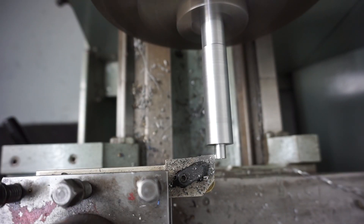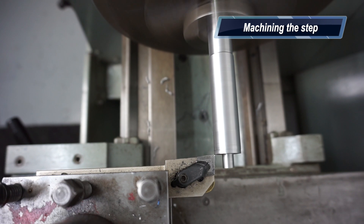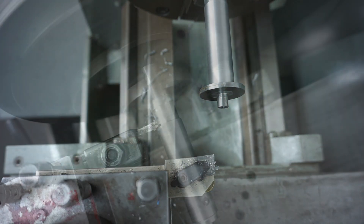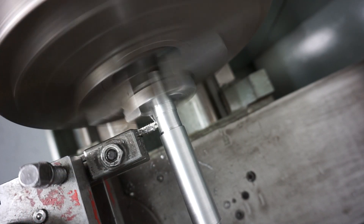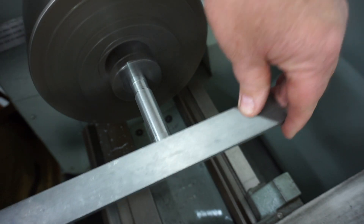This is a little spigot that goes inside the original camshaft. I had to machine a step on the shaft to accept the disc, and I also needed to make a step on the opposite end - I couldn't get in with my tool, so I used the parting tool for that. You can see here I'm machining the opposite end with the parting tool; commonly you don't try to machine like this, but sometimes you've got to do what you've got to do.